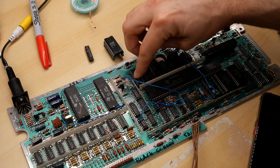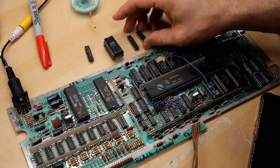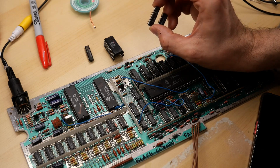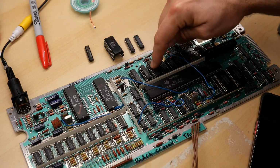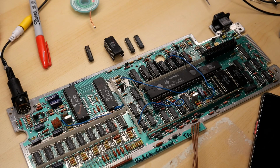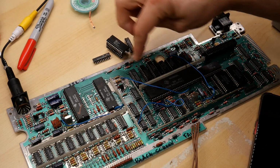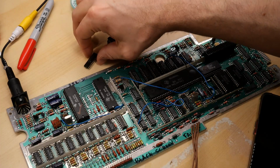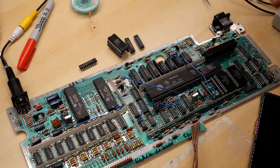Now, these are the 3 logic chips that were in here on the motherboard. I just swapped them out with new ones just to check. But these 2 chips, which are the 244 and the 245, this chip and this chip, those check good in the MiniPro. You can validate those types of chips. This chip here, which is the center one, is the 74LS373, and this one no longer tests good in the MiniPro.